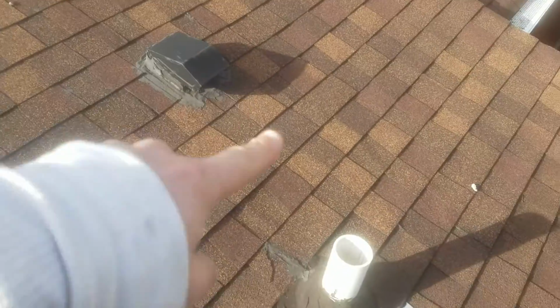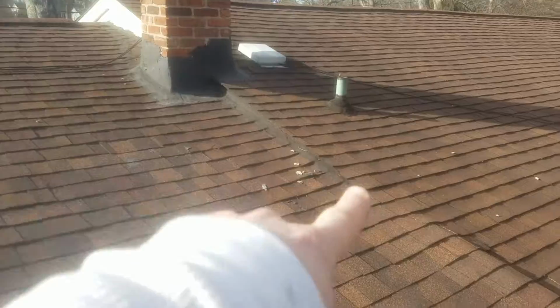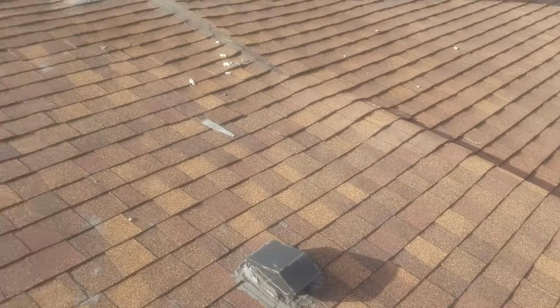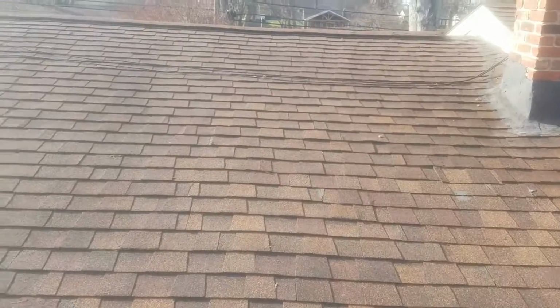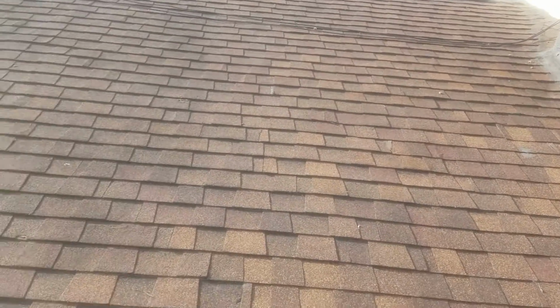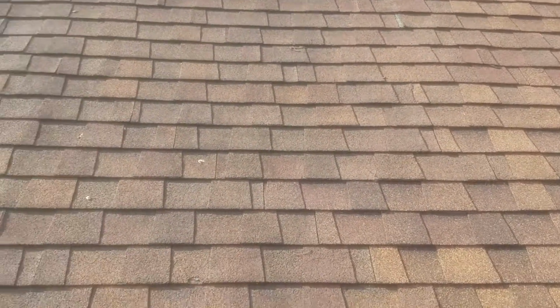This whole section, left, right, up and down, these two skylights, these two vents, those two vents, brand new lead at the chimney, new step flashing everywhere, new white trim there, and the Cap Master sleeves. Of course, new ridge vent across the peak too, but not the soft ridge vent. I use the hard ridge vent called Snow Country ridge vent. Real good stuff. And that's it.